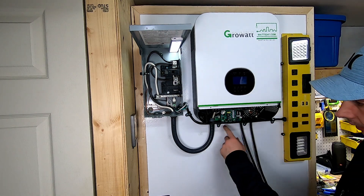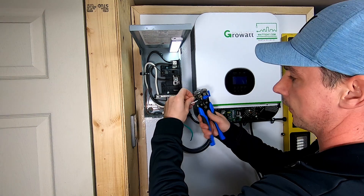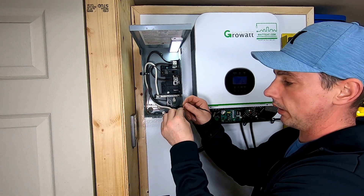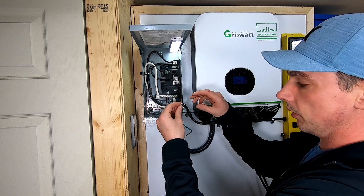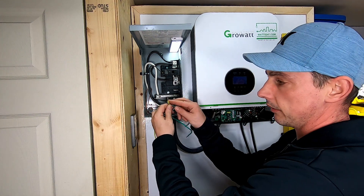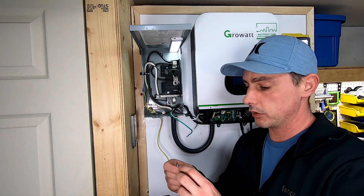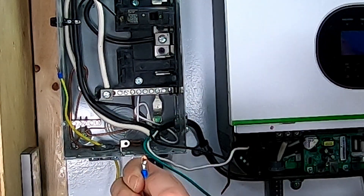The light bar is over here - it just comes out of the bar, comes across the bottom here, runs into the box, and these are the ends here. Now if we strip these wires, you can see this is a stranded wire. If you were to screw that into your breaker or into one of these bars, the screw would just twist open the wire and you might get very little contact, which is not enough - it's going to create heat. So what you're going to want to use in that case is a ferrule. What the ferrule does is when you put the screw terminal on it, it squishes in and holds all the wires together so you get a good connection inside your panel.